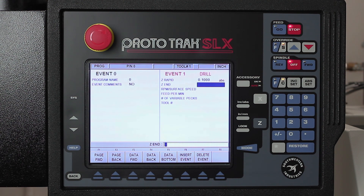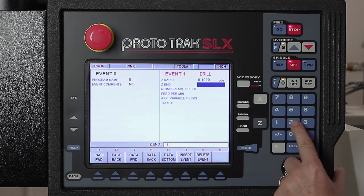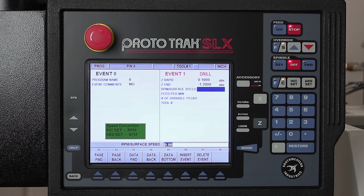In this case I've got to drill through this hole at least one inch deep, just to make sure I have enough because I want to tap through this hole. I've already bored out the other side of the part so I can go all the way through for the next process. So I'll go an inch and two hundred thousandths deep, and I use the minus sign to make sure I go in the right direction.